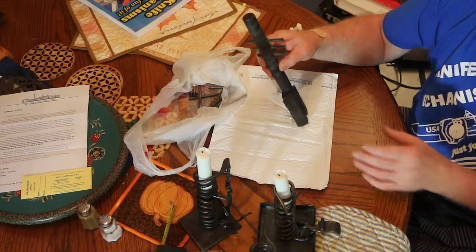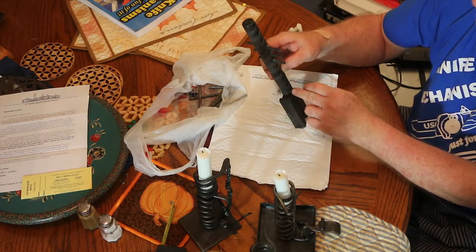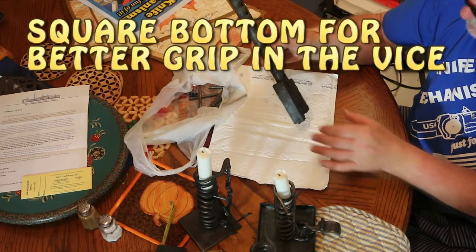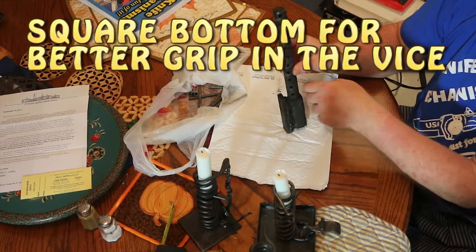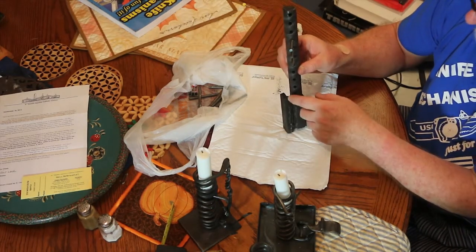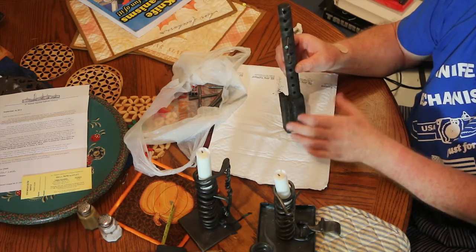What I did was I took the mandrel and drilled holes in it, spaced out, and I squared up the bottom. Eventually, I left a little notch so this will catch the quarter-inch rod as you get started. And eventually I ended up using a clamp or something on there to make it a little bit better.